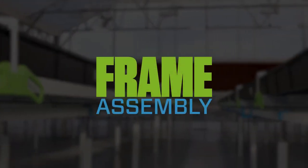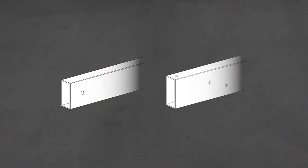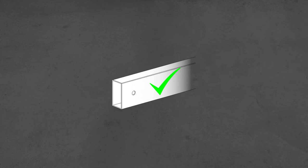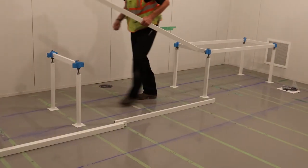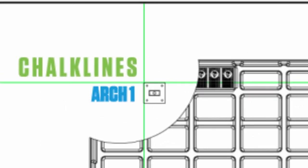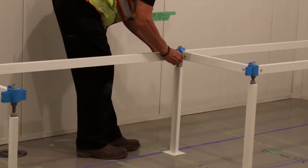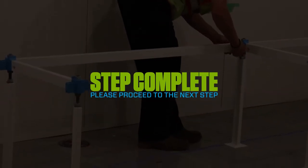Step 3: Frame assembly. Frame tubes and table tubes can be distinguished by their hole differences. For this step, we will need only the frame tubes. There are two different frame tube lengths: long and short. Identify the short tubes and set aside. Before step 4, assemble the frame using the hex head screws in roughly the final position in which it will be installed. Start with the end of the bench where the drain will be located — the arch at the drainage end will be arch 1. Using only the long tubes, complete the frame and finish with the short tubes.